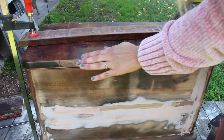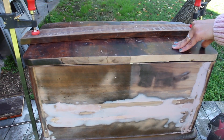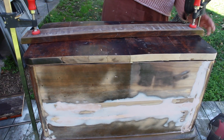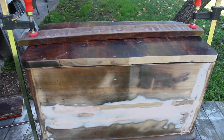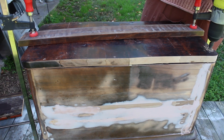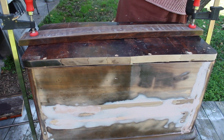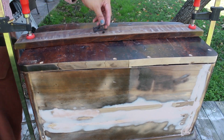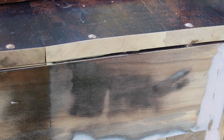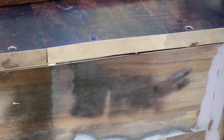You don't mind my different wardrobe changes — I lost the clip for the other day so I'm picking up where I left off on the second nightstand. This wasn't done in one day; it was quite a bit of work so I had to space it out whenever I had time. What I'm doing here is pre-drilling the holes so that the wood doesn't crack when I put the screws in. Then I'm going to use a countersink bit to countersink them even more so the screw head goes flat into the surface, and when I Bondo and patch it you can't see them.